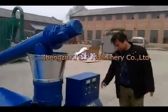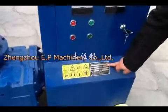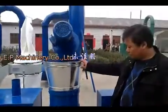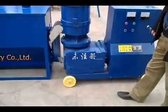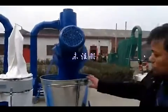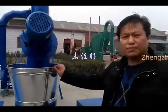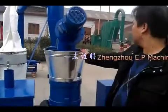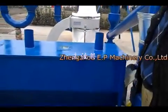This is a pellet-making machine, made by Zhengzhou EP Machinery. This is our latest design for making pellets, and it is connected with the gearbox. The inside rollers are rotating rollers with a stationary die. It is the best pellet machine for making biomass materials like sawdust. After this pellet machine, it will go through to another process.